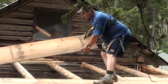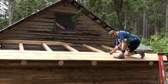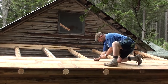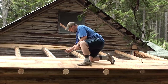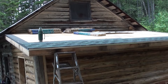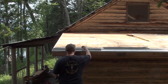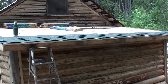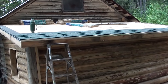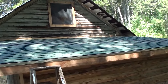I got some really nice wide pine boards — they're 14 inches wide — we're going to do the whole roof with those. Coming out pretty good, nice and flat. The rafters I used are working pretty good. It's been a good morning — I got all the drip edge and starter shingles on the edges, then did about three rows of shingles from the ground where I could reach them. It's easier to do from the ground than up on the roof working behind you. Today is overcast and cooler, a good day to lay shingles. I couldn't be any happier with how the roof came out — it went right in between the two logs. Till next time, signing off.